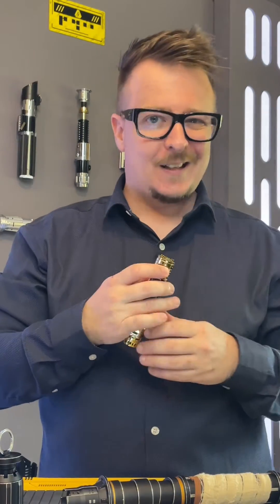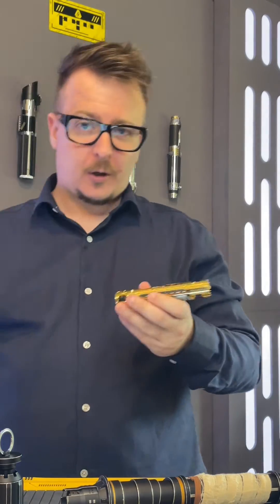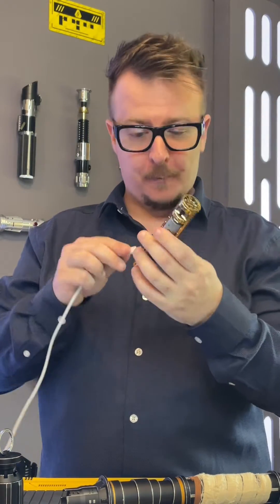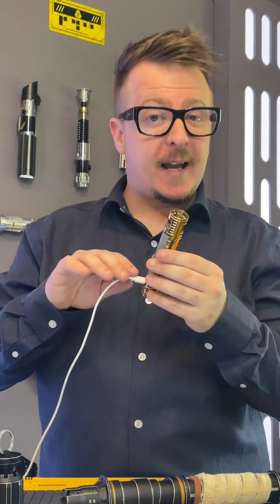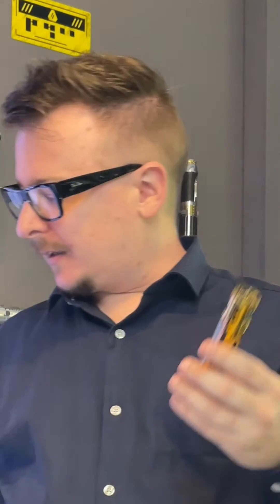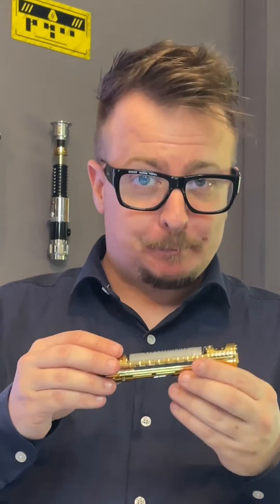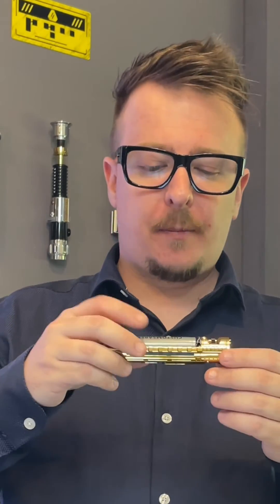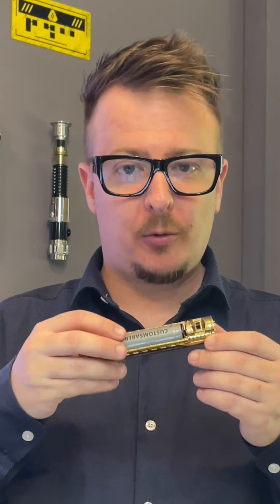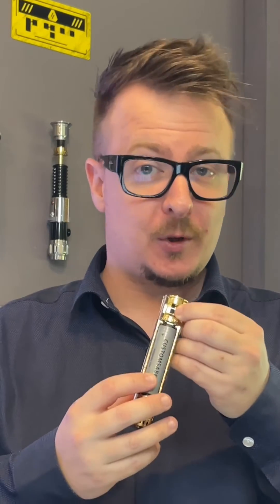For a more detailed explanation — it's a little quirk — but if the switch is off and you plug it in, you still get the sound cues. That's because the board is actually getting current, so it believes it is charging, but the power doesn't go to the battery because the kill switch is off.